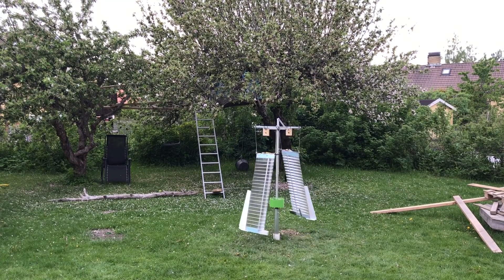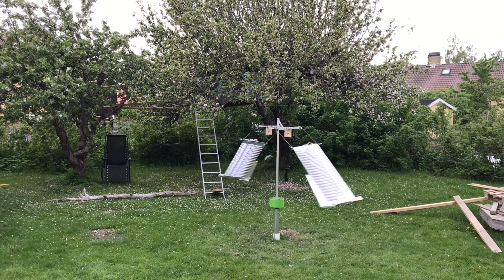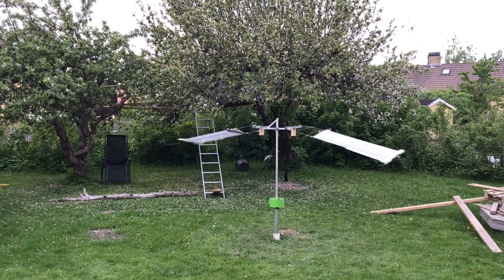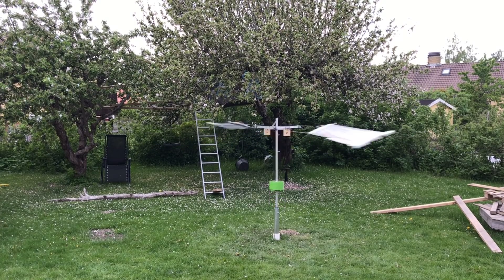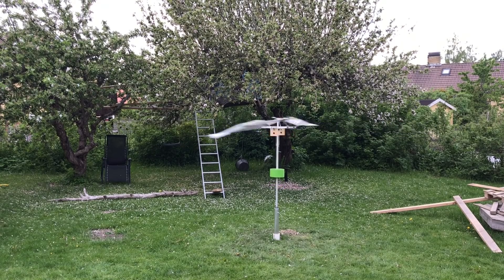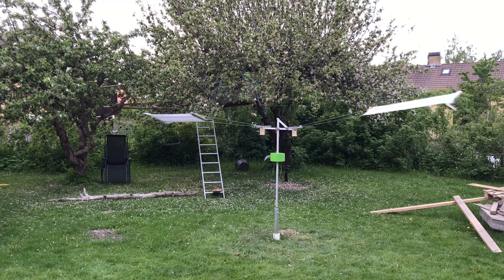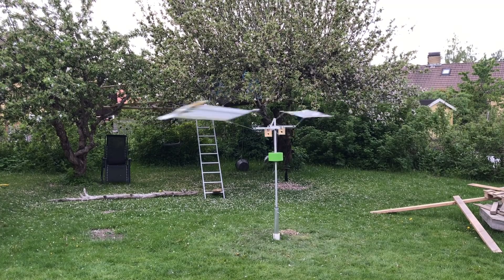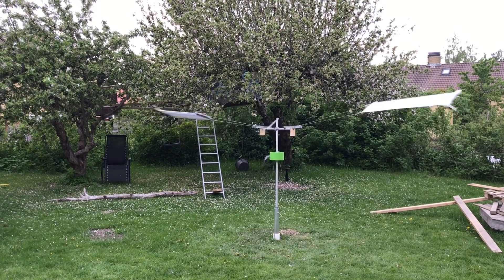Here I'm trying out a simplified version of this rotary system. The wings only have a fixed pitched-up control surface at the outer part of the wing, so they are basically independent flying wings. They are pulling up a centrally mounted weight, so the lines extend depending on the centrifugal force, and the system is pretty stable.